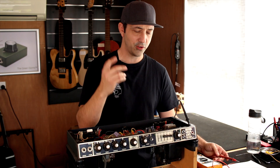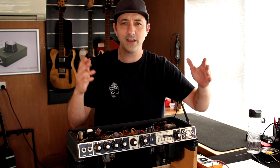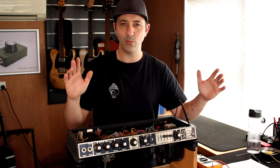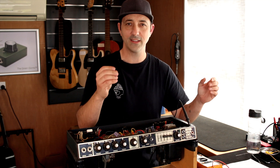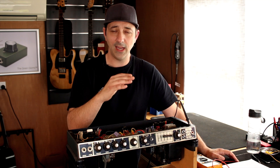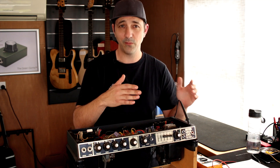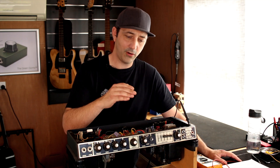Don't do this work if you're tired, and don't do it with distractions around. No phone sitting right there, don't be watching YouTube. If you've got kids like I have, don't let them come into the workshop when you're working on amplifiers. Same with pets — get them out. If you look down for one second you can touch the wrong thing, and that's the end of you. Our workshop hours are 8 a.m. to 6 p.m., but I won't work on high-voltage tube amplifiers after 4 p.m. — from then on it's pedals, guitar work, anything but high-voltage stuff. Make sure you're nice and fresh.